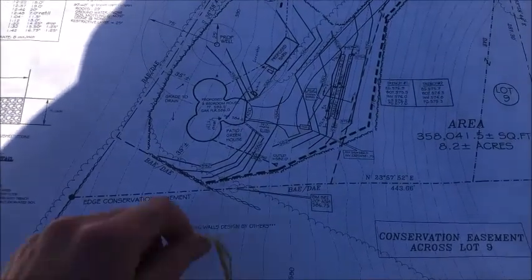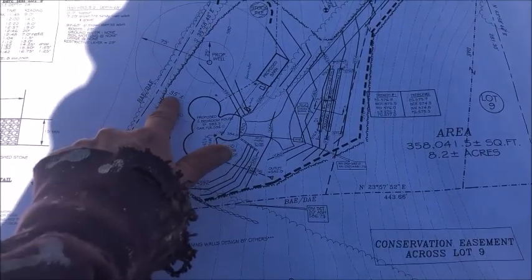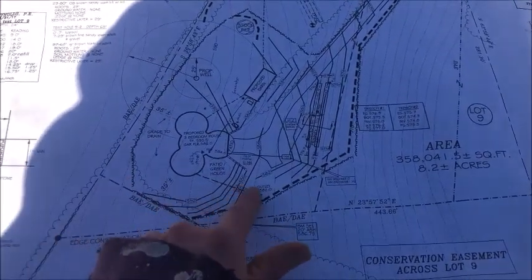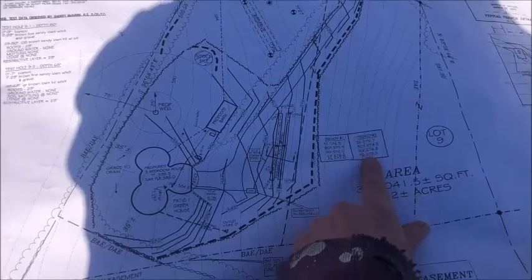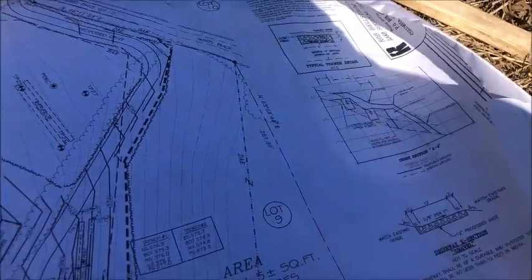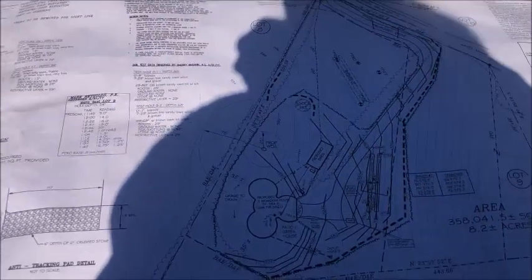So next thing I have is actually your first step. Your first step is to do a site plan or a plot plan. Depends on where you are in terms of what you call it, I guess. This puts your proposed house on it. You can figure out exactly the orientation you need with setbacks, where your well will go, how the land will need to be graded for drainage, where the drainage goes, the driveway, if you have a septic, where your tank goes, and then where the trenches are, and the details about the trenches. Over here, it's how you do it, like what's the depth, etc., including what the driveway should be. Lots and lots of details.